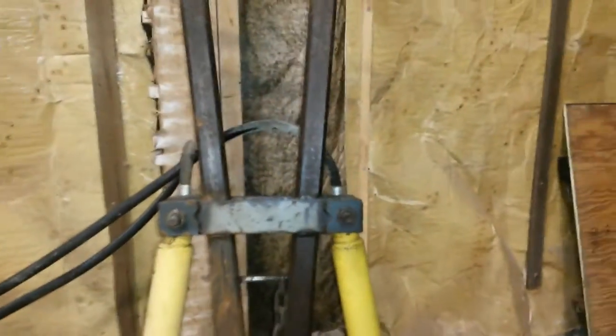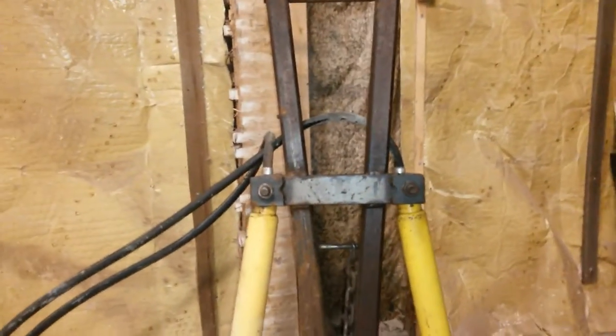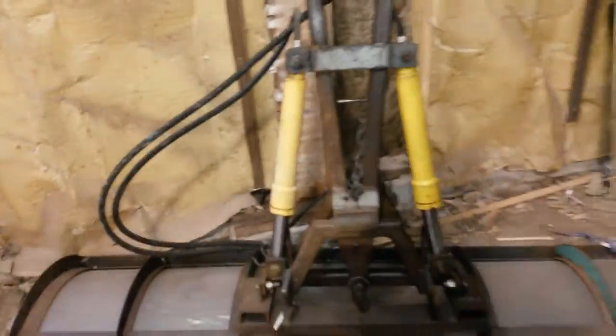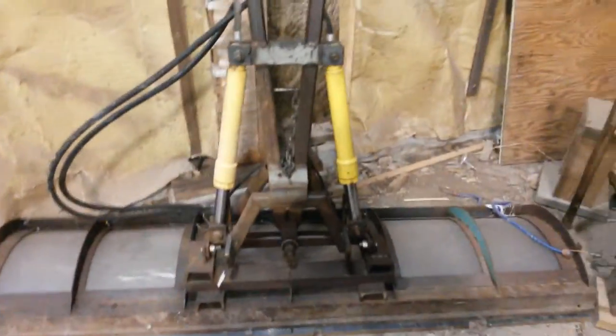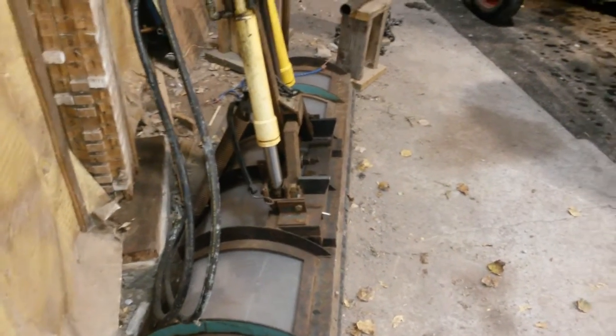The hydraulics tip it back and forth, and it has the usual trip so that when you hit something big and heavy it'll tip up. That is our snow plow assembly that we have built for this tractor — it has just springs on it to prevent it from tripping, but it's very good to have it trip, trust me.